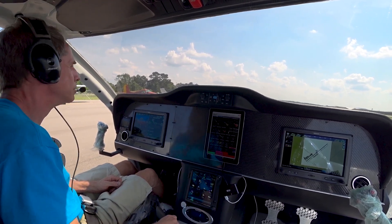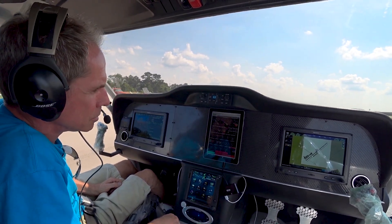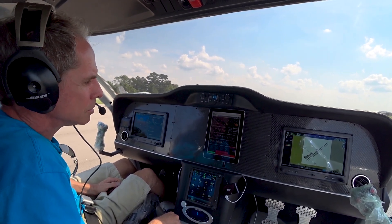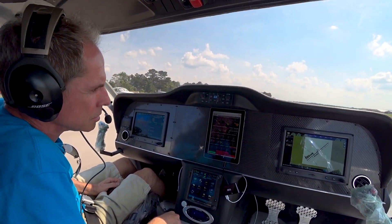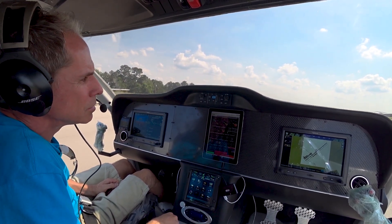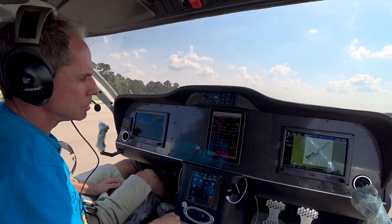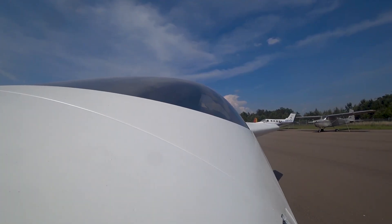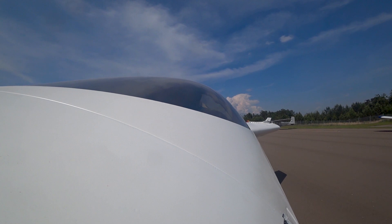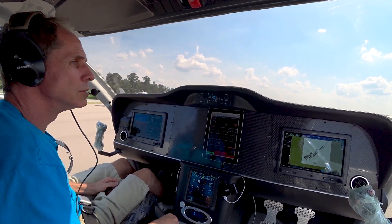After all that, I taxied it back. It was sounding a little rough because of the coolant that had gone out, but I never got over about 256 degrees maximum on the oil and coolant — so not pushing it too hard. I get the same temps in my old car stuck in traffic on the freeway on a hot day with a not-great cooling system, just not getting much air across the radiator while idling. Overall I'm pretty happy with that, and happy I've figured out a solution for the radio interference.